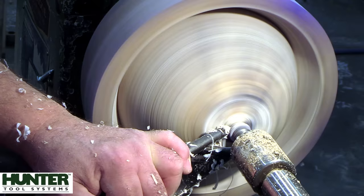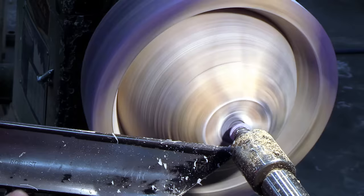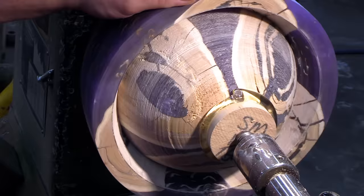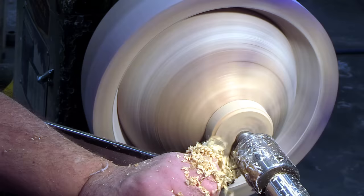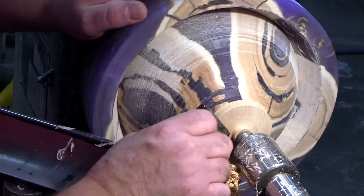I should mention we're using the Phoenix here, and then you'll see me come in with the parting tool just to get underneath that little live center dimple. Once that's done we'll hit it with some 60 grit. That casting was stuck in there pretty good. After I hit it with the 60, we'll come in with the glue block - an off-cut from peppermill production, which is why it says SM for spalted maple on the bottom. We'll trim this down so we've got a good solid tenon on this one for its size, and we'll be able to take out yet another core.